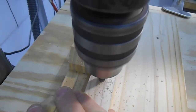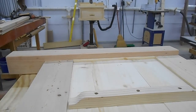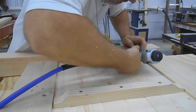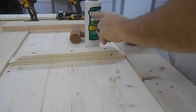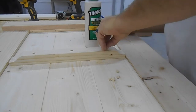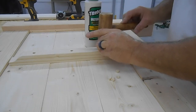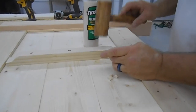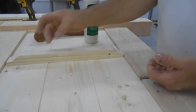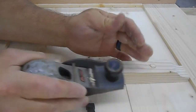In order to be able to fasten these to the back of those boards, I also cut plugs and plugged those holes. Then I glued and fastened a small strip on each side of the leg to cover up any raw edges that were still exposed. I just flushed that up with a block plane and then sandpaper.